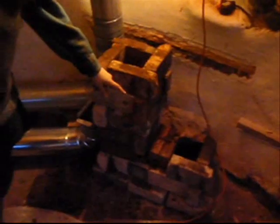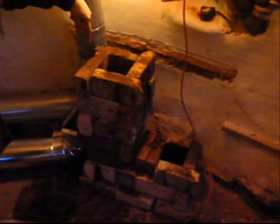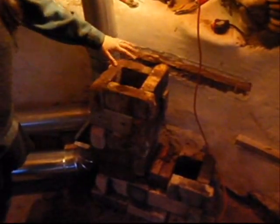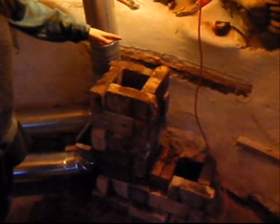All them piles of bricks — what's up with them piles of bricks? Alright, them piles of bricks is a roughly J-tube rocket stove. So the wood goes in there, fire burns sideways, flue gases get all mixed up and re-burned in here. We're looking for the right size barrel to go over the top of this — redirect those flue gases for a little more turbulence at the hot point at the top. Re-burn all those flue gases — all that smoke is unburned fuels.